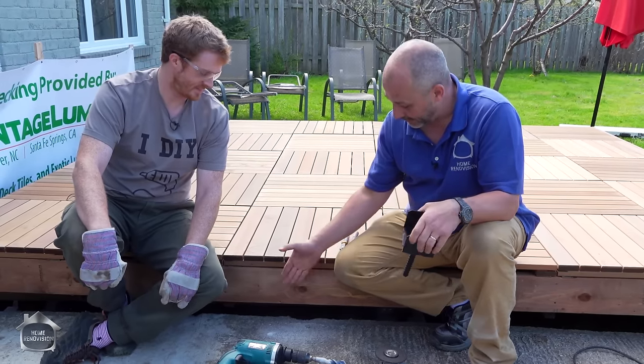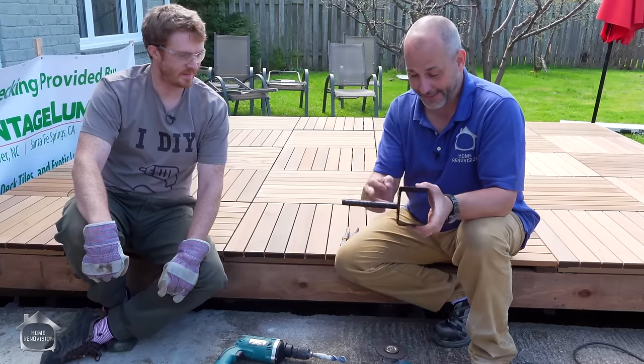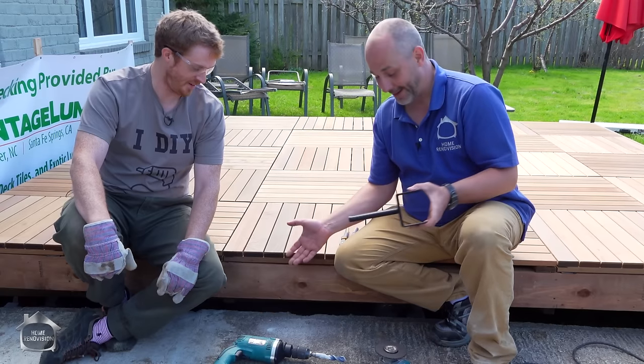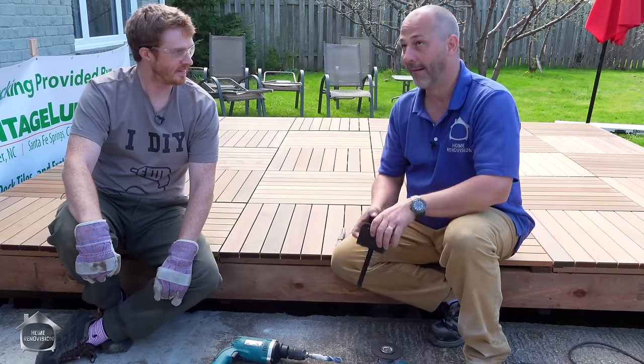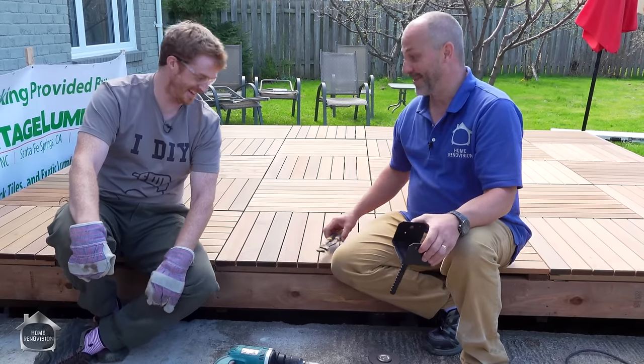So we're going to just drill some holes. We're going to fill it with hydraulic cement. Okay. And then we're going to cut this down a little bit so we don't have to drill 9 inches deep. Because this is not new concrete, right? No, it's not. And then we'll set them in place and we'll tap con some screws into them, get these posts installed. And then we're halfway to a pergola. We've done a lot today. Yeah, it's been a busy day. It's been a good day.